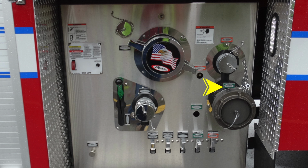Moving to the right, large diameter discharge, and you can see once again the electric valve requires that you have an override. That is this location, which requires a tool. All the way down to the very bottom, you'll find on the very left-hand side an additional drain. Once again, turn, not pull. And to the right, you'll find all the associated drains clearly labeled.